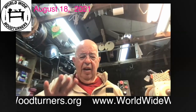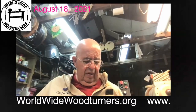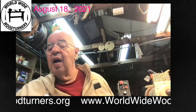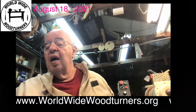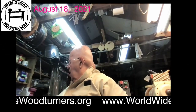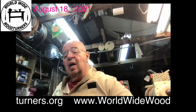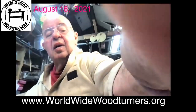I did a lid out of it and domed it so you see the color coming and going. And it's nice, but there's another thing I found on the black. I use it for accent on the top of some of my finials. And what I found is, to prevent it, because it chips so badly and splits so easily, I wound up soaking it with super glue, and that greatly increased my likelihood of it actually making it through the process.